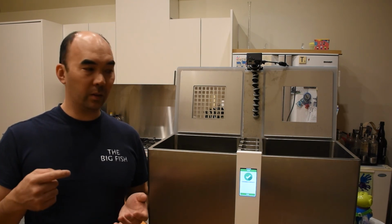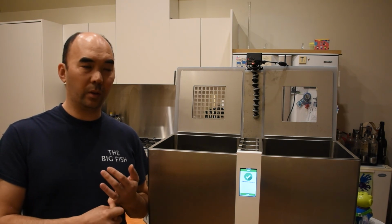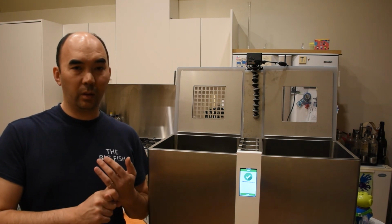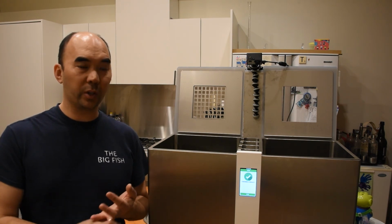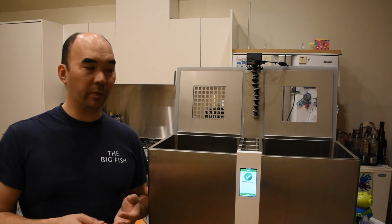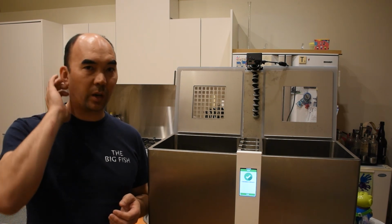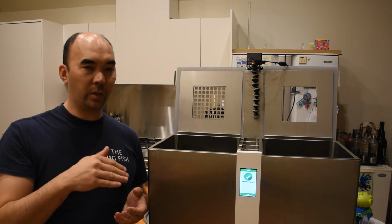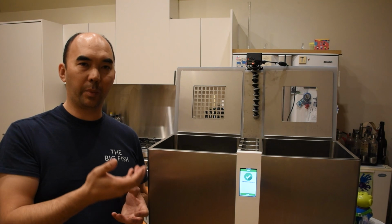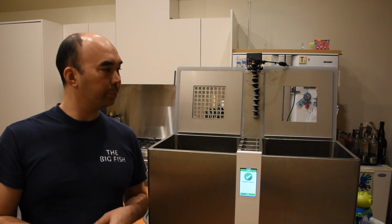Just to recount the particular tips that I've got, don't try to clean all of the insides of the tanks during the first water cycle. Wait until it's actually heated up and use the brush instead, taking advantage of all of the steam. As you're draining the hop tanks, or as you see the hop tanks draining, add an extra little bit of water into each of them. It just agitates the sediment built up at the bottom of each of those tanks and makes sure that all of those are clean all the way through.